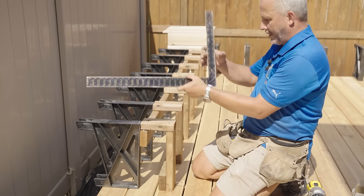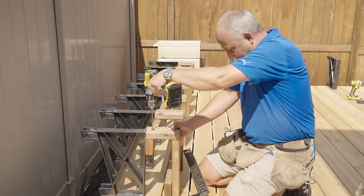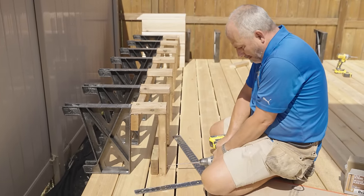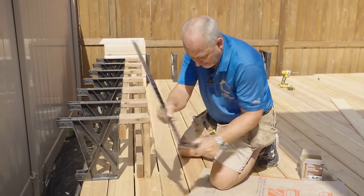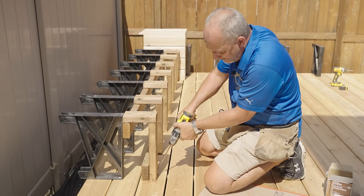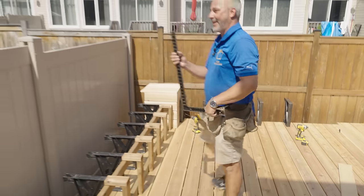most important thing I have going on here right now is getting this square. Okay, so I want to come off my bracket, put that in position, drive that in. Now, there we go. Just want to put that on there. That's beautiful. I am going to drive one screw, reverse, get my angle. There we go. I'll lock that in a couple of locations now. We're gonna square this off, throw a screw in.